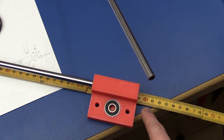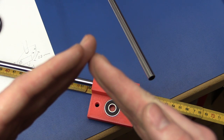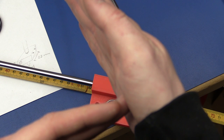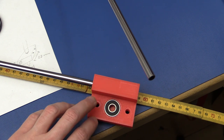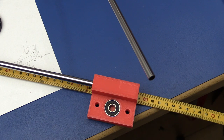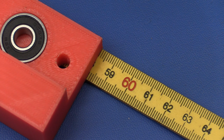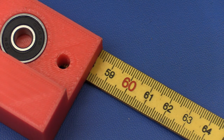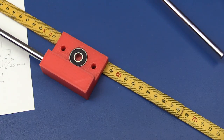The box is going to be 60 cm, and we have to subtract the width of one plate because I'm joining them in a square — one overlaps the other in each corner. The front will look a little odd that way, but it's the best approach for fewer parts. It needed to be pressed another 6 mm — I got it spot-on, but it was tight at the end so I had to use a rubber mallet. As they say: don't be violent, just use a bigger hammer.